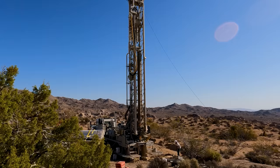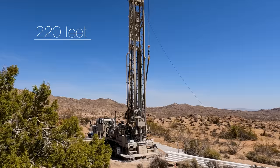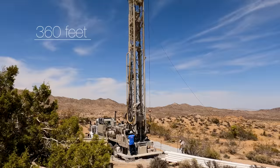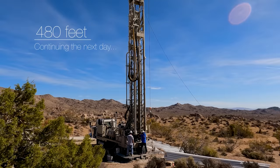And so we drilled — 30 twenty-foot sections of drill rod, all the way down to 600 feet. That's maybe the height of a 50-story building. In this area, you're not expecting to hit a big reservoir of water, but rather veins — spaces in fractured rock where water flows between them. We don't need a crazy amount of it; it's just for a house, with a water storage tank to steadily pull a small amount. What's amazing is that there's only steel casing for the first 20 feet — the 580 feet under it is just a hole through rock, stable enough to not cave in on itself.